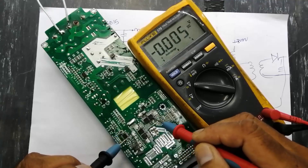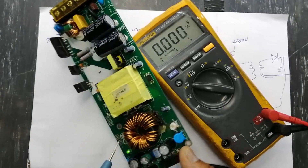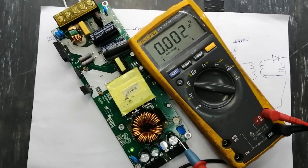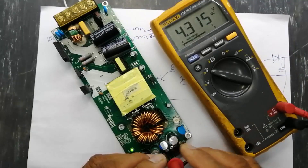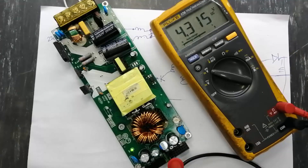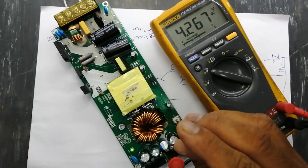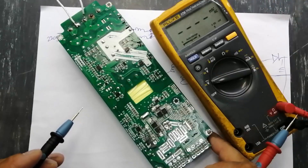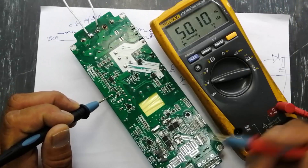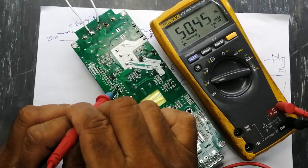There are four diodes in both sections — four diodes total. After that there is a filter, and we have four capacitors in the output. There is a voltage adjustment potentiometer RW1, currently reading 4.31 volt. We can adjust the output — now set to 4.2 volt. We can also check the switching frequency: it is switching at 50 kilohertz.